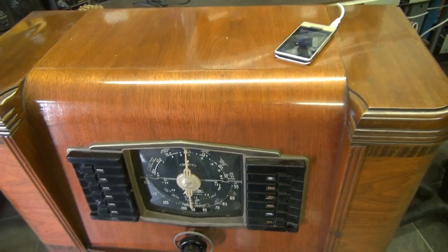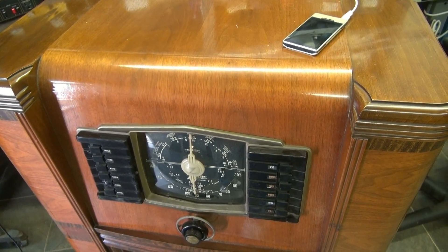So that cool old radio in your house can now play an MP3. Although the audio quality is not perfect — because we're taking a stereo device, making it mono, feeding it into a tube amp in a circuit that probably doesn't want it — it still sounds good. It makes a nice addition and brings some life back to these old radios.